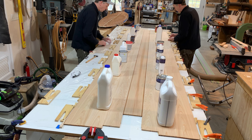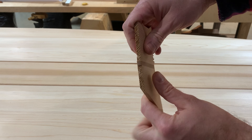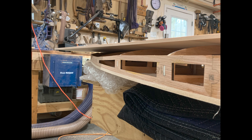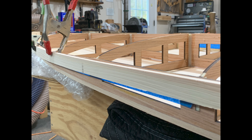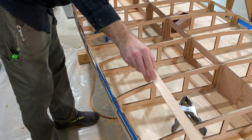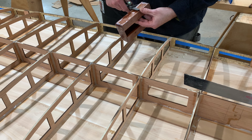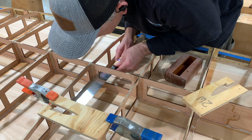The flexiness I was talking about — we're not super worried about it, because very thin cedar actually bends a lot very easily. So there's a little discrepancy there with the deck. Hopefully your kit will have that taken care of before you get it, but if you have to knock down this little bump, you can. This happens in boat building with molds anyway — sometimes you take a batten, put it across all your molds, and you see one frame needs to be sanded down a little. Do that now, so your sheet will go down nice and flat.